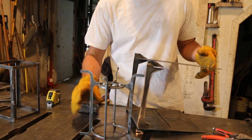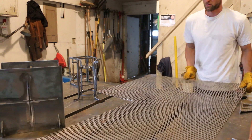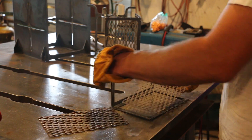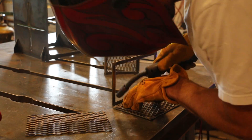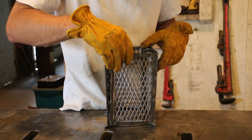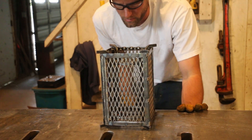Jig worked. We had some really thin expanded metal leftover from a project we did on the farm, and I thought it worked good to fill in the frames. I marked it with a Sharpie and then cut it out with the angle grinder. Some small tacks around the outside held these in place. I had to cut the enclosed frame in half because I found out it wasn't going to fit around the inner piece. With it cut in half, I could put both sides in place and tack them back together in the same spots where the other tabs are, and you couldn't tell the difference.